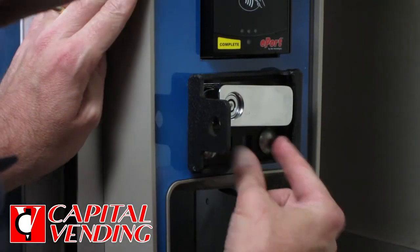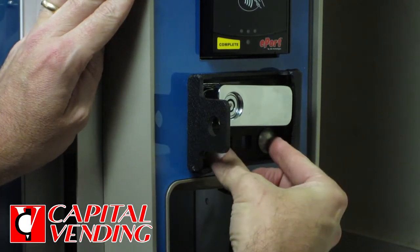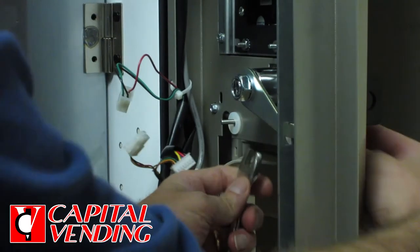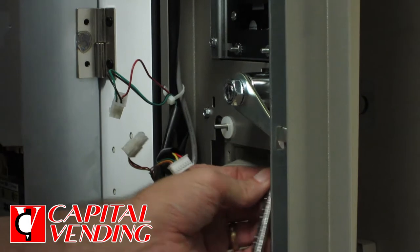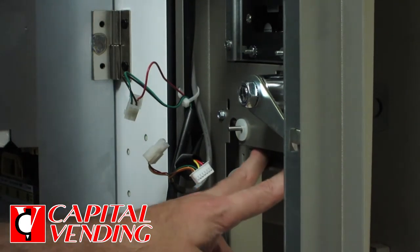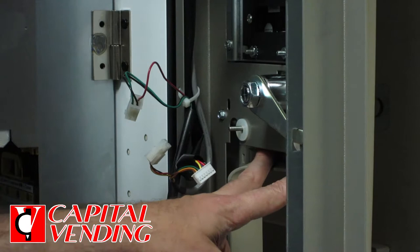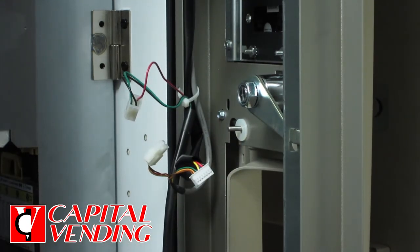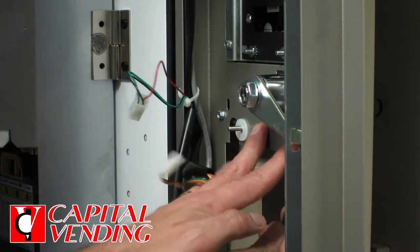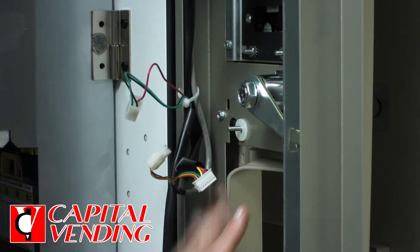Here I am on the front of the machine. On the outer two I marked these positions with a Sharpie, used a small drill bit and then a larger one for my hole placement. I put the carriage bolt in and with an open-end wrench I twist the carriage bolt and hold the nut, then tighten it up. The kit comes with two basic washers — you could use larger ones, but the basic washers typically provide enough surface area so the hasp is not easily pulled off. Once you have those nuts tightened, you just replace the cup and you have your hasp installed.